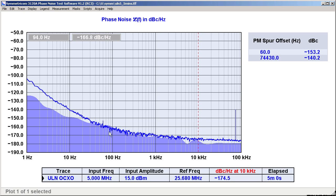Closer to the 1-over-F corner, around 100 Hz, the trace variance is higher, and there's little or no margin between the instrument floor estimate and the phase noise trace. This is a nice smooth flicker corner, and we're measuring the noise here at a remarkably low level, but we can't be 100% sure where that corner really is. Also, note what's happening closer in — the instrument floor has fallen below the measured trace again.